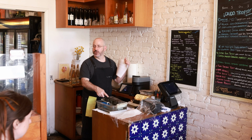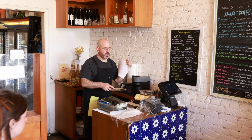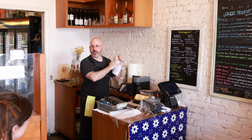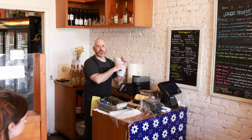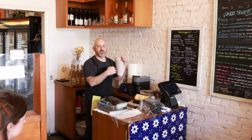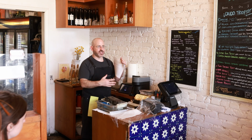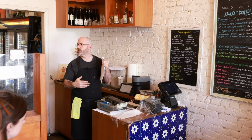And so our tip adjustment for sharpening our knives will always involve some lifting up and some rotating towards the spine, and that is true on either side of the knife. And we will do that until the bevel width comes into contact along the spine. That is the amount that we need to do. And so that's what's shown here. And you'll see that that's also true for thinning. We still need the spine to come into contact with the stone by lifting up and rotating back towards the spine. So that is the way that we deal with tip adjustments when we're doing both thinning and regular sharpening.